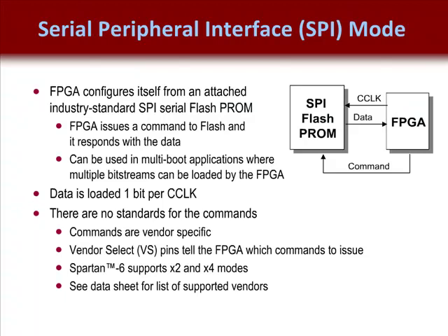Note that the available SPI flash PROMs use a single 3.3V supply voltage. All of the FPGA SPI flash interface signals are within specific IO banks, so consequently the supply voltage for that IO bank must also be 3.3V to match the SPI flash PROM. This implies that any IO pins assigned by the user into that IO bank must also be 3.3V compatible.